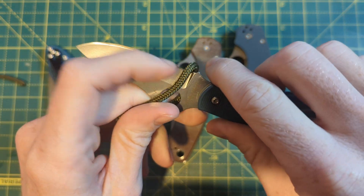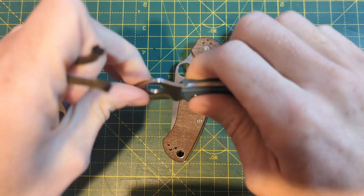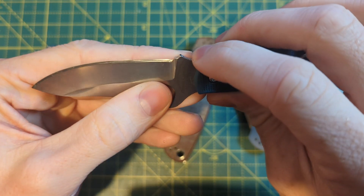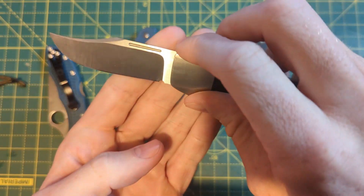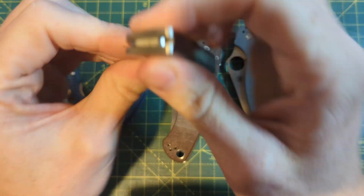This one's got a very tiny choil, so this one probably won't — and yeah, that did bind a bit on that. So even with this teeny tiny choil I've put in, it wasn't as proficient at cutting rope. And with a large choil like this one, which is what I see a lot of people put in, it really does make it more difficult.